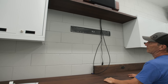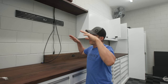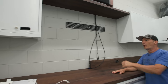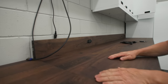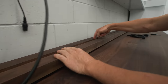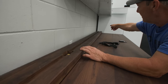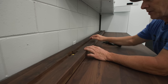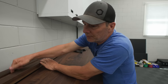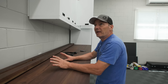I put the TV bracket up and was thinking about trimming the paper stone around it, but Matt pointed out this is a really slim mount and we might not be able to get the TV to hang if we do that. So I'll pull the screws, lay the paper stone down, then screw through the paper stone into the wall. The backsplash has milled-out cutouts for outlets and a slot to run power and speaker wire to the speaker terminal pocket. I'll use hot glue dabs rather than stapling to keep wire in check since this material is very hard.